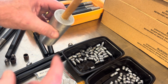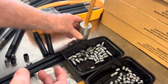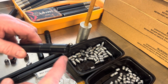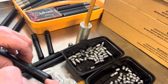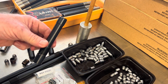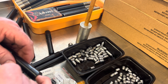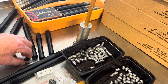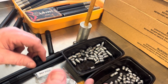It probably comes down to whatever pellet's being used. I want to let people know I figured out why it's happening. I sat there and looked at these things — it's hit and miss, because I have found AEA barrels like this 50 cal that are chambered for some reason. Some of them are chambered, some are not. Some of them they've already created it where a 50 cal round will fit in; there are shorter ones where it won't. There are 45 cals where it won't. If they don't have a chamber you need to have that chamber made — all it is is running a hone in with a lathe for about 20 seconds and you're done, or using steel inserts.